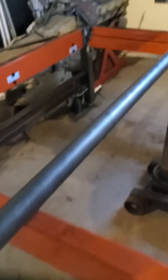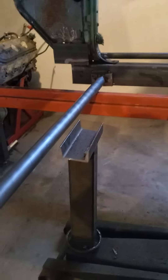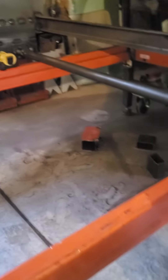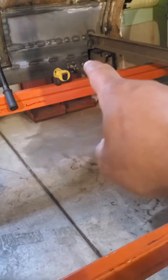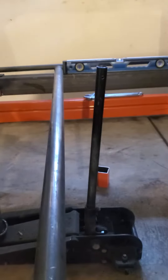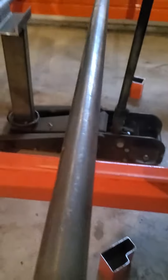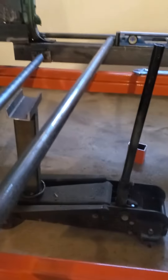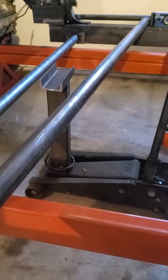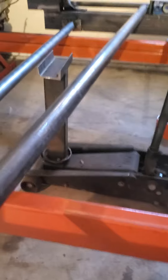All right, so now all the fun stuff is rocked out. I have the new front crossmember that is bolted in, welded in, and then I also have the back welded in. They're 59 inches from the top of this one to the top of this one on both sides. Everything is square and straight. And as you'll notice, the bar that I used just for jacking everything up and getting everything level and square — I'm still going to keep this because I'm probably going to weld this to the chassis jig.